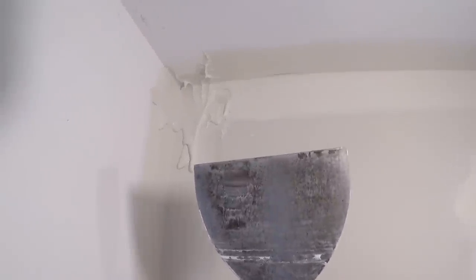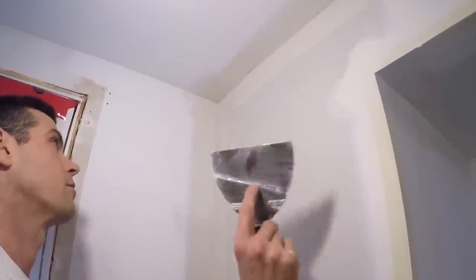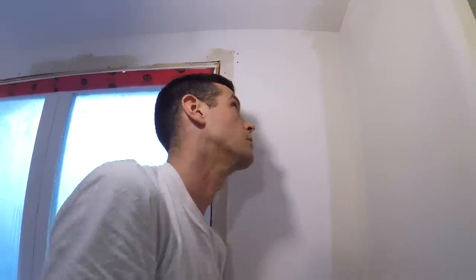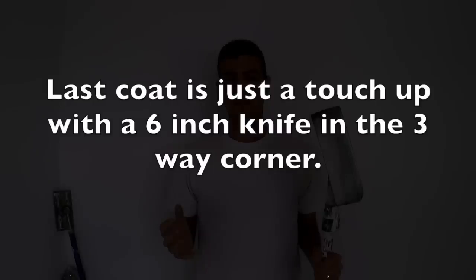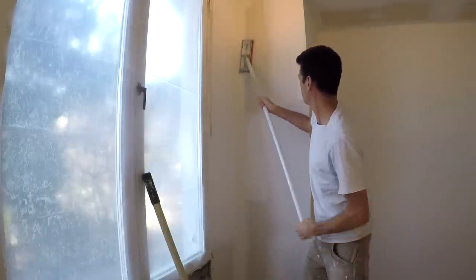So what do we do with that horrible mess? On the last one I used a four inch knife; this time I'm using a five inch knife. Last time I did all the right hand sides, so this time I'm going to do all the left hand sides. And then you might just get in there and tune up stuff like that — but I'm going to leave that because it's going to scrape out and coat nicely for my last coat. The last thing I do to complete my angles is quickly run this sander into the corners. After that, it's a couple of quick passes on the edge with a regular pole sander just to feather down the edge, and they're done. The only spot I really need to look over is where joints intersect in the corners — it usually takes just a little bit of sponging to get out any small niblets I may have left.